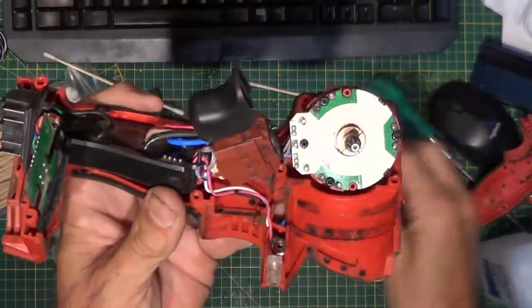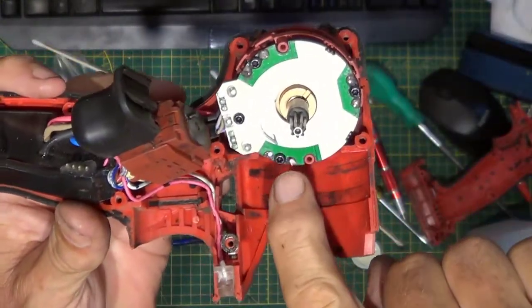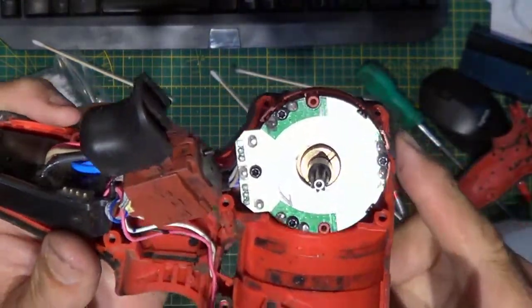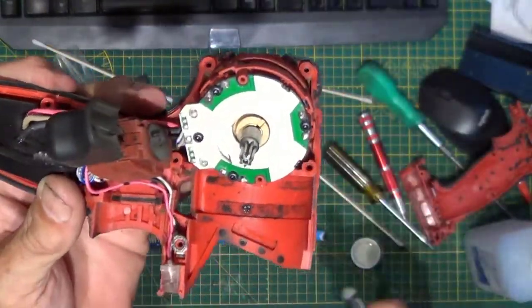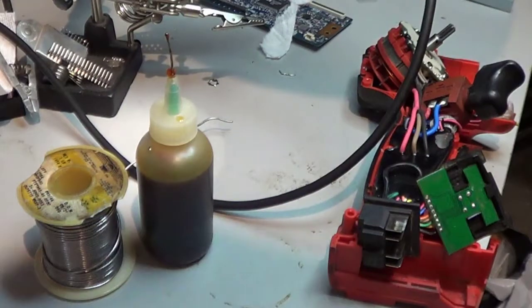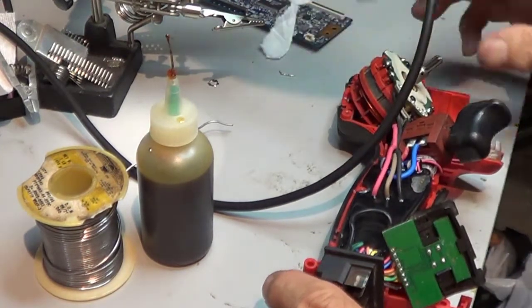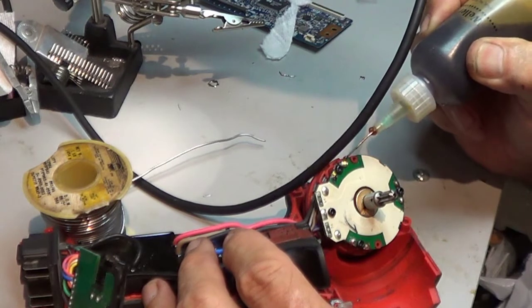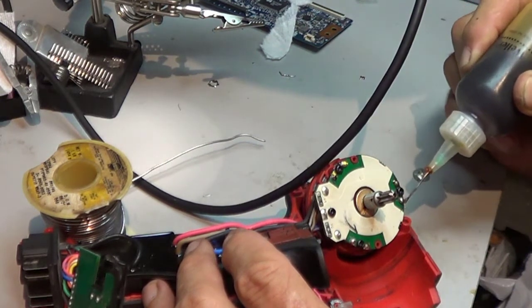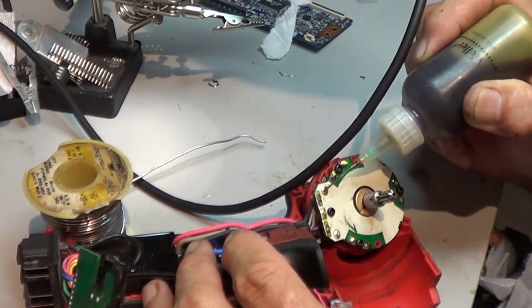Didn't take long — I did have to use an old toothbrush and a nylon bristle brush, but I've got most of the gunk out. Now I'll be working on the electronic contacts, got most of the grime off the trigger assembly, and once we're done we'll see if she works. My workbench is a little cluttered because I've been busy with about three other projects. I've got a nice hot soldering iron, some solder flux, and we've got the solder. What we want to do is reheat these contacts and add a bit of clean solder — hopefully that'll solve the problem.